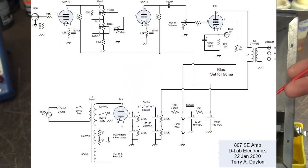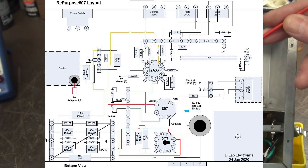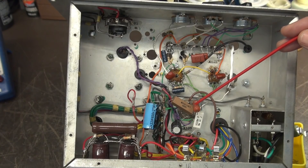I've redone the schematic and the layout. If you guys want this information, just send me an email and I'll send you the current print. The old 6L6 amp print would work fine if you reduced the high voltage to around 400 volts — I bet she'd drop right in place. But we're limited by the output of the power transformer and there's no way to lower it to accommodate the 6L6. On the new print, pretty much everything stayed the same except for changes to the power supply, and the base configuration on the 807 is different.